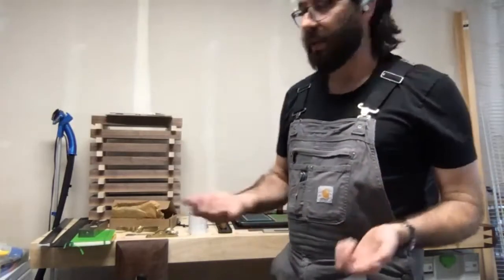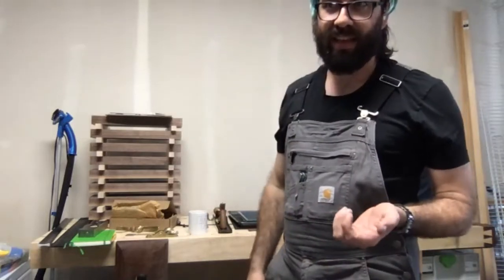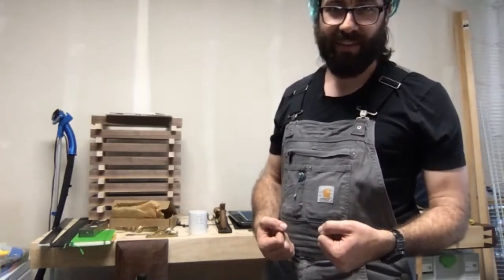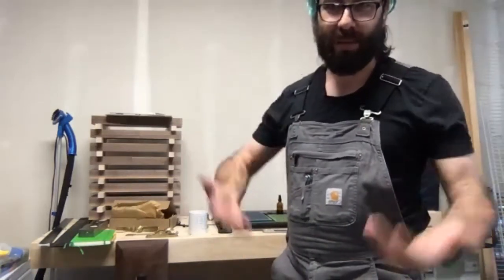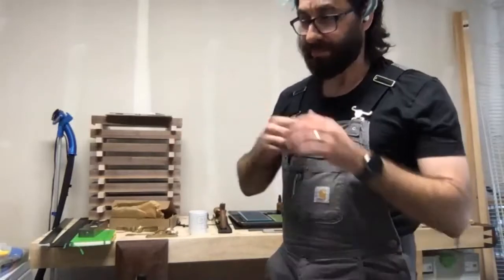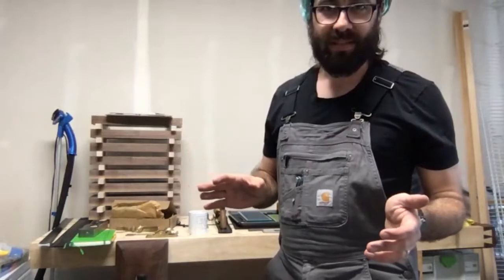And that means that while I'm in the middle of a project, I will sharpen it before the project, and then I will work with an increasingly dulling blade because I don't want to go through that half hour or more. And then you end up working with crappy stuff the whole time. But if you do the secondary bevel, it's a minute to get everything back to sharpness.